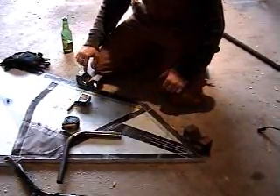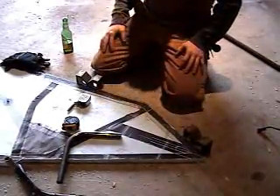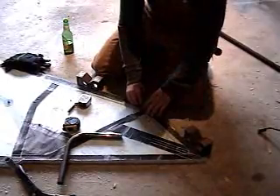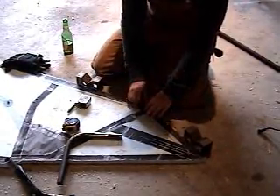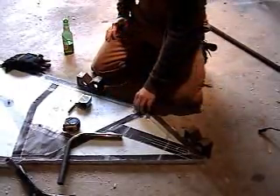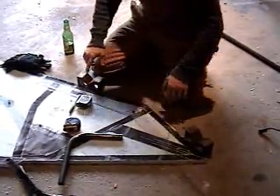The legs of the protractor are completely touching the faces of the V-blocks. Once I'm done doing that and I know it's set, I'll lock this in place, and once that's locked in place, I can tell you what my angle's going to be.